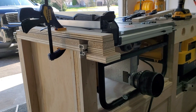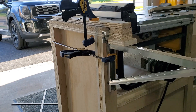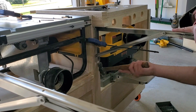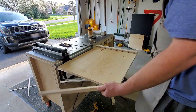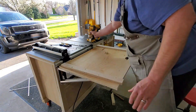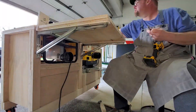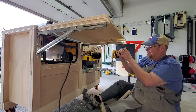Next I'm moving on to installing the back shelf. I've built a little jig because the folding bracket needs to reach around the sliding mechanism on the saw, so it would be very hard to line that up. By building this jig — which is representative of the layers above it — I can get the placement exactly where I need it. Using that as a top reference, I can install the brackets just like I did on the other table, then repeat on the other side. Because this bracket sits lower than the other shelf, I need to install some spacers on the actual bottom base piece — three-quarter inch spacers about an inch and three-quarters wide — drilling and offsetting the screws so they don't interfere with where I need to screw the brackets in. I put a board in there to space it out three-quarters of an inch from the track to give me a little clearance.